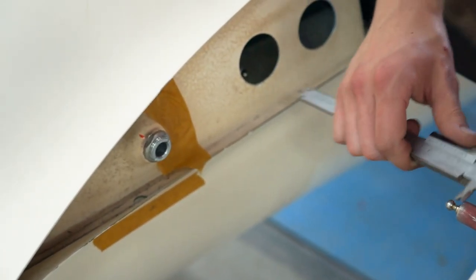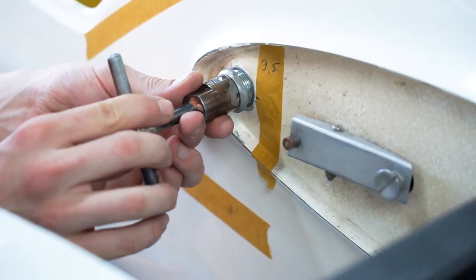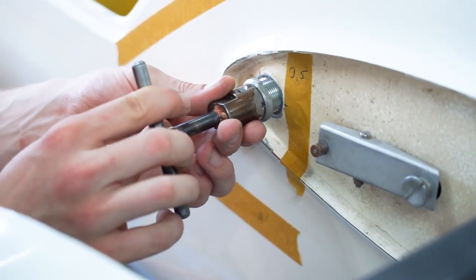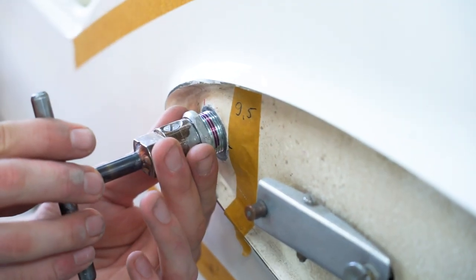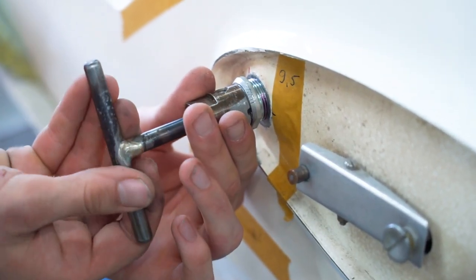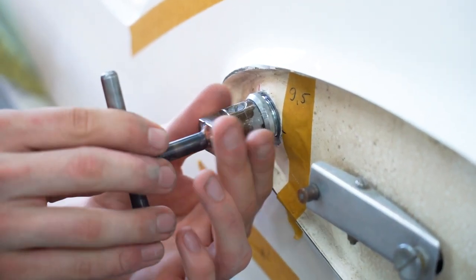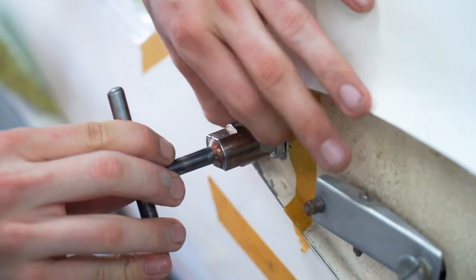Here you can see how the bushings are turned out exactly 4 or 5 times, depends on what you chose, and then screw locking put on, and we screw back in the bushings, and yes, that's how it's done. We had to repeat this with all the 4 bushings since all of them had clearance.